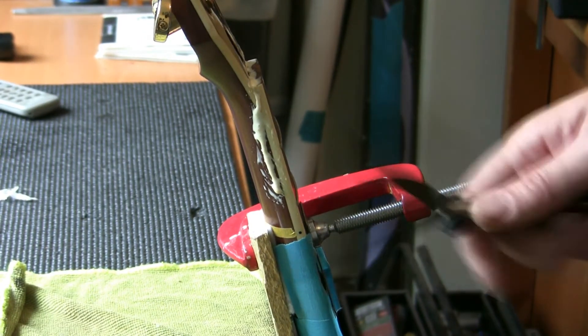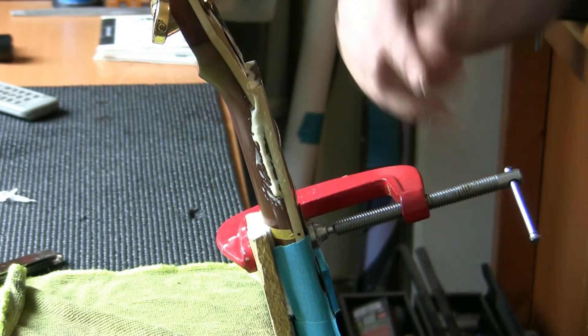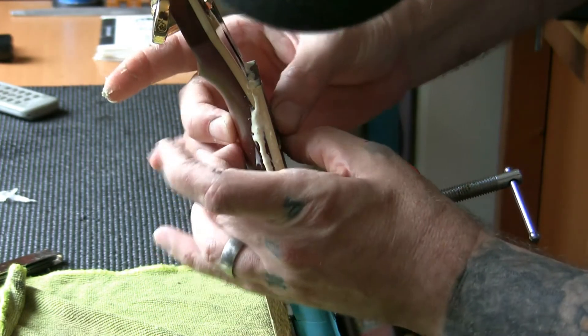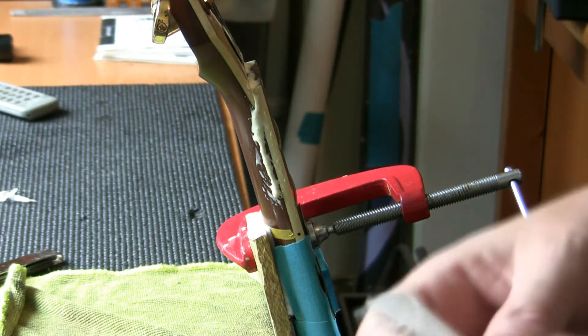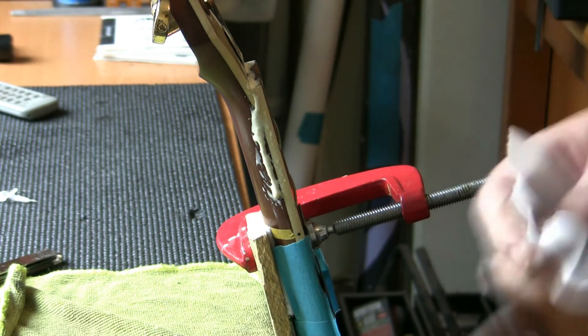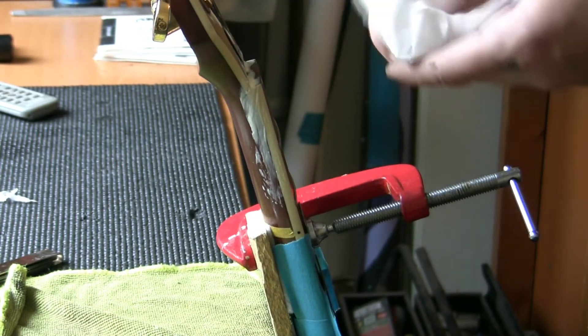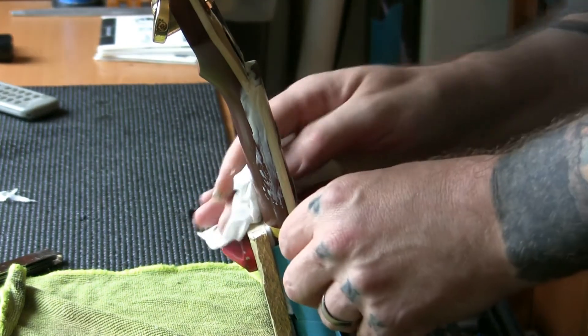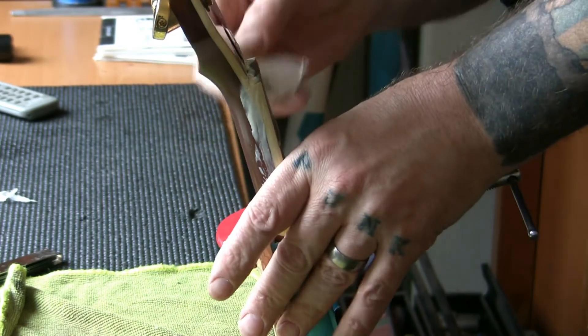Right, I've done cramming glue in there. I've just removed the wedge and the feeler gauge and now I'm on to cleaning up both sides so we can get it clamped. We're going to get some squeeze-out that we can't control — we are not bothered about that in the slightest. I'm satisfied we've got glue everywhere we need it to be.